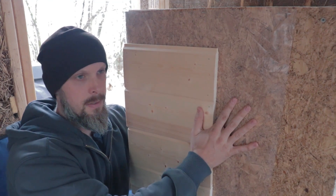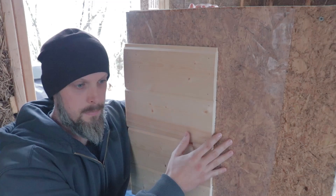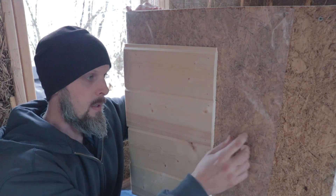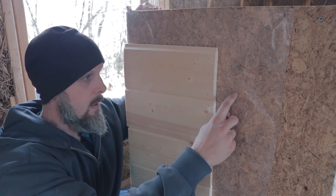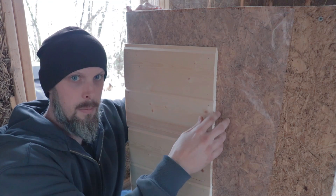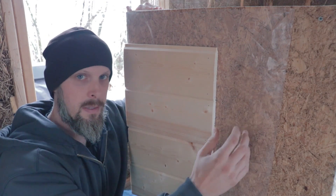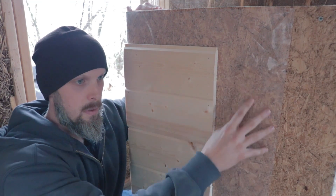This system has all kinds of failure. We know that your modern stick frame home is just a breeding ground for mold. During construction, a lot of this plastic gets put up too early, sunlight degrades it, it gets damaged during construction with little tears. All the nails put through the cladding can potentially tear the plastic as well. So there are all kinds of possibilities for water penetration, and once it gets behind the plastic it can't get back out — or has a very hard time. All that moisture tends to build up behind the plastic and totally defeats the purpose of the water-resistant barrier.